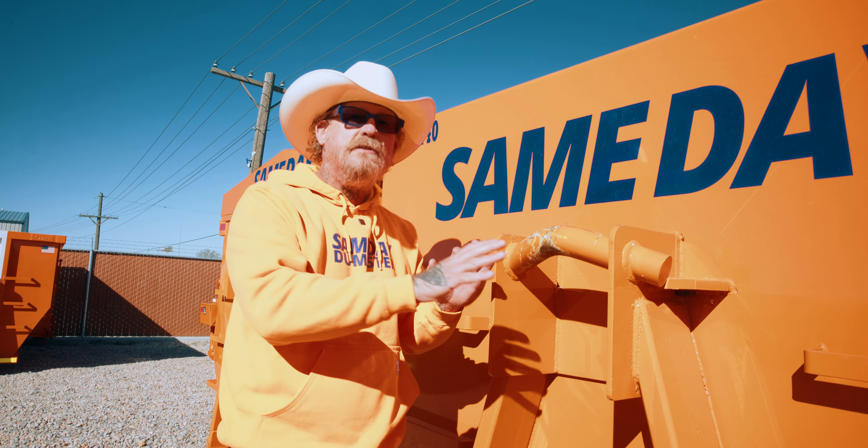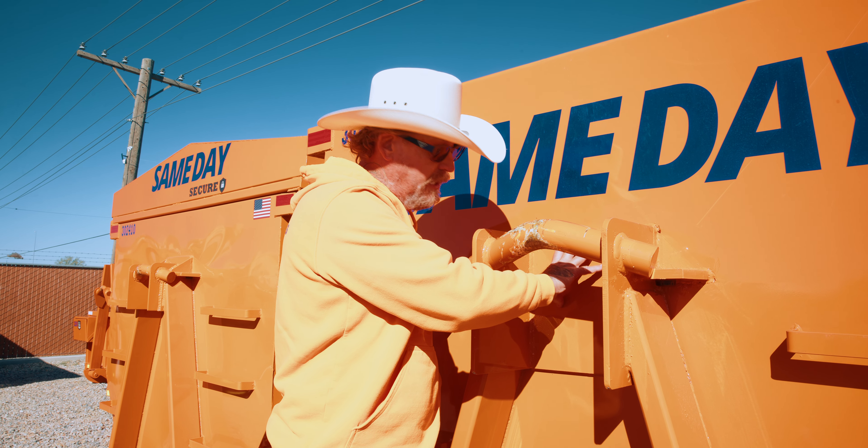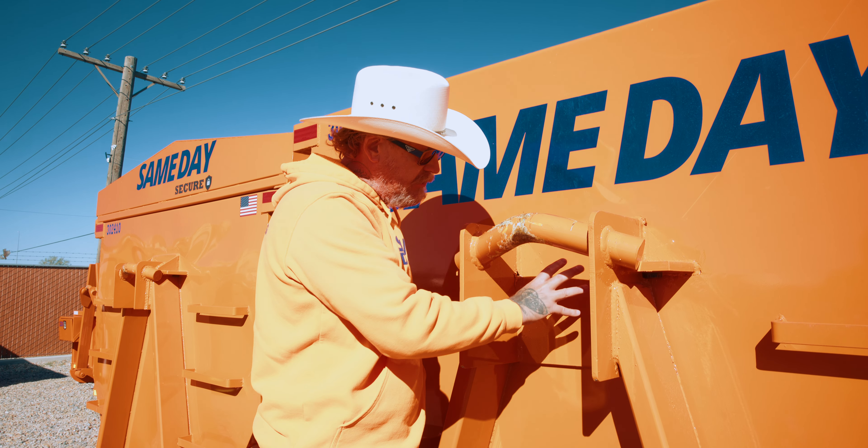But if I did slip off my bar, the back of my jib would hit this plate that Matcorp put on it. Because hooks wear — they wear out a lot. It's a wear item, a wear component. When it wears out to the point, you cut it off and re-weld another one on. That plate has strength and integrity engineered into it, but it also ensures that if that thumb slips, the back of your jib hits this and pushes the can so your full hook can never get caught underneath there.